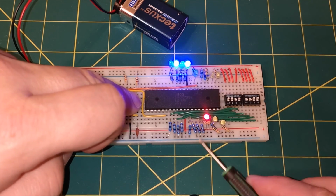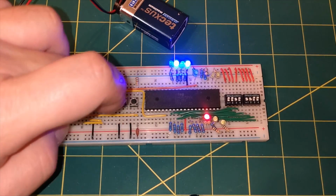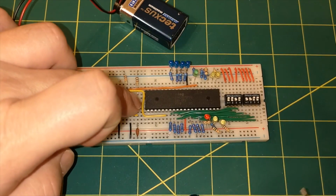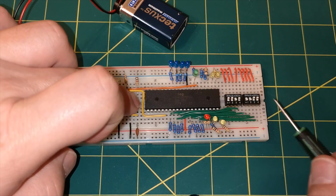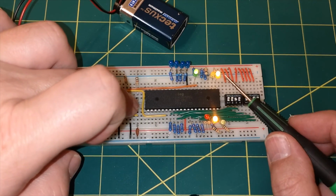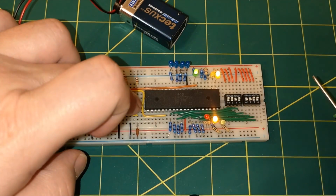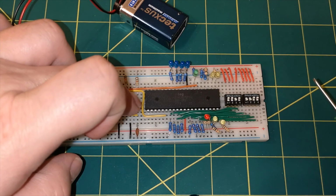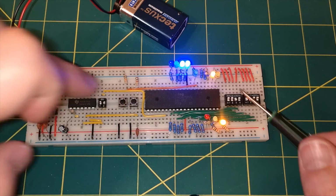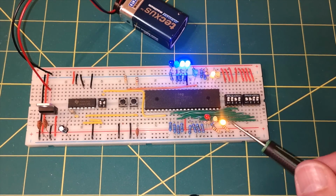I think what's happening here is we're actually in a halt condition, so I'll need to give it a reset. So we're fully reset and it should start up and read our output instruction. There's the M1. Again, I believe that's a memory read, so it should read the instruction. And then eventually we do get to the IO request line coming on.